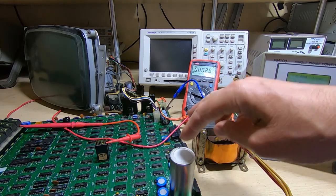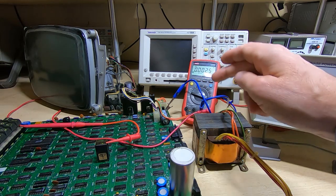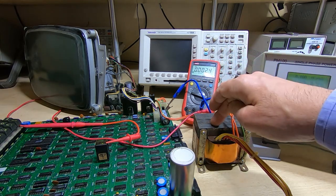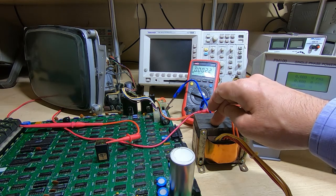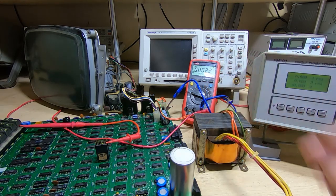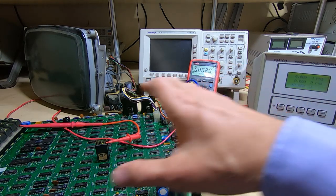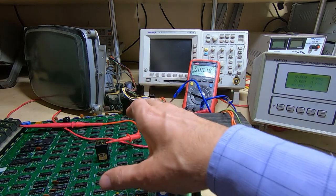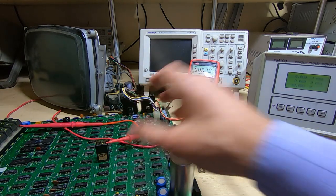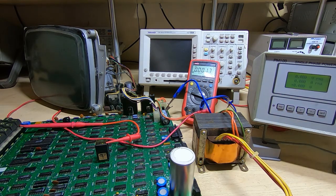What I'm going to do is hook a scope up to the 5 volt rail and probably also to the output of the bridge rectifier, and we'll have a look at that and see what appears to be going on, and if we can make any headway. It might be there's something failing on the board, but I don't think that's the case. I don't think it's the power going up, because we're seeing the incoming power actually going down, so a bit of an odd one there.